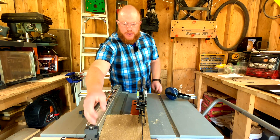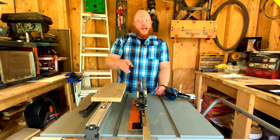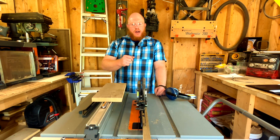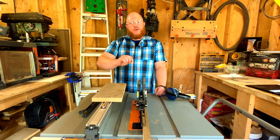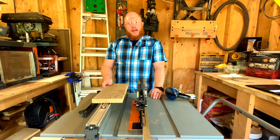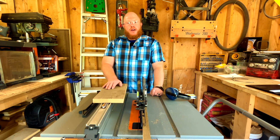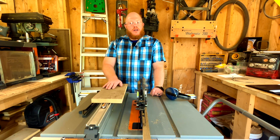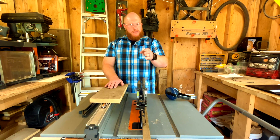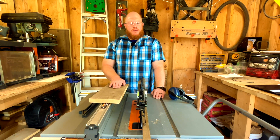After the cut, another safety note: if you have a longer board, you'll want sawhorses or another table set up slightly lower so the board has somewhere to land as it comes through. There's nothing worse than running a big board and having it bobble while you're trying to push it — very unsafe. If you don't have outfeed support, have your spouse or a coworker stand on the far side of the saw to grab the board as you feed it through. This tool is very dangerous if you don't follow proper safety protocol.